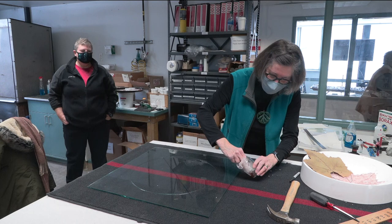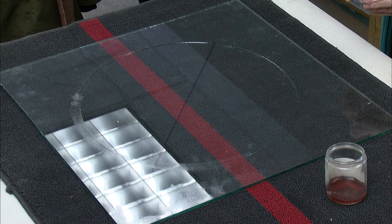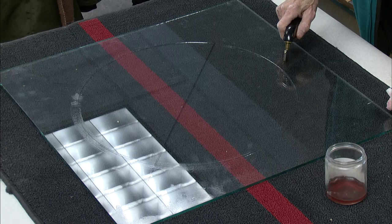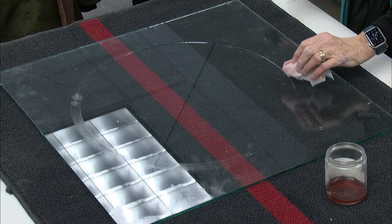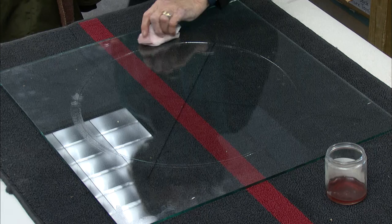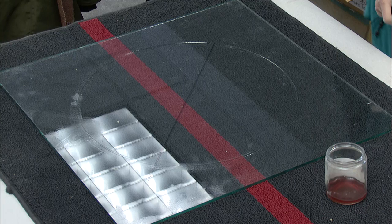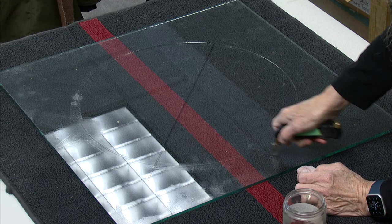And the idea is you want to have the score stop before you get to the ring. Now the glass is going to bend, the glass is going to run here, but then it's not going to know where to go, and hopefully it'll stop, or it'll go just to there. So we'll go around. Okay,